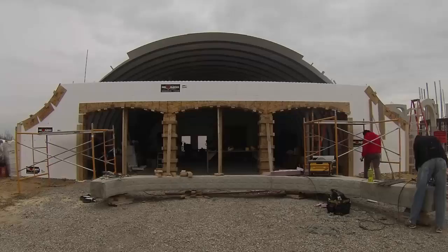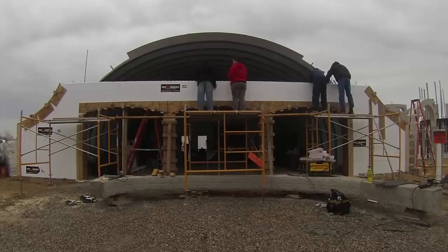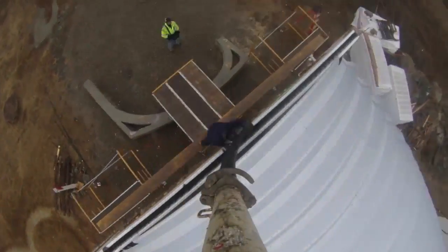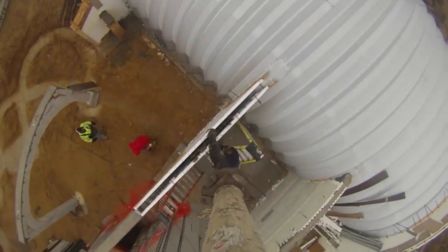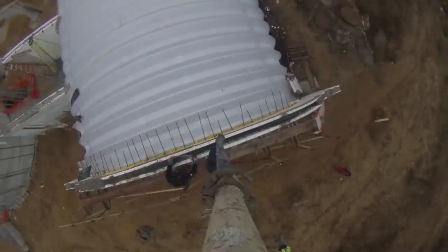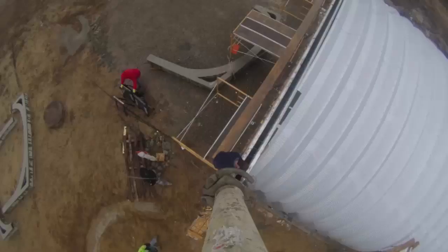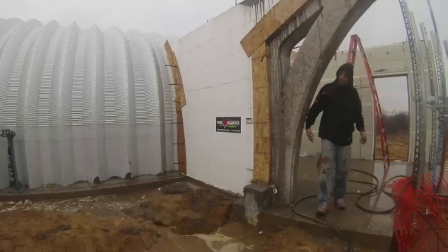Pour day came and I still needed to set up the scaffold and finish some rebar work. Ryan helped with cutting the rebar, and meanwhile the inspector came and checked everything out. We attached the camera to the pump truck hose to get this shot. We started on the south wall but just filled it part way to give the concrete a chance to set. Then we moved over to the mudroom wall and filled that halfway, then over to the north wall and filled that one to the top. Sometimes the hose clogs and needs to be blown out. Then back to finish the mudroom wall, and finally back to finish adding weight across those garage door arches. The guy dumped what was left on the sand — I'll use it as a base for my rebar bender.